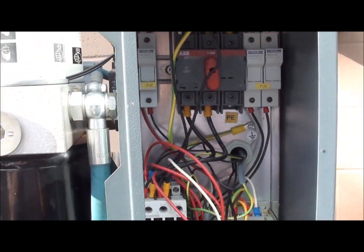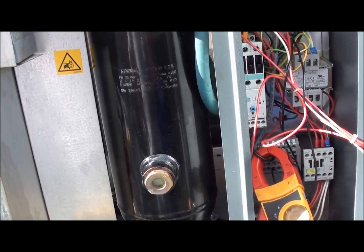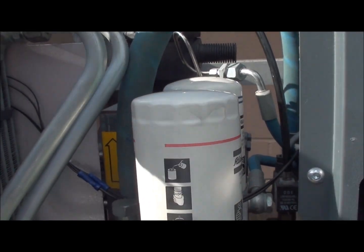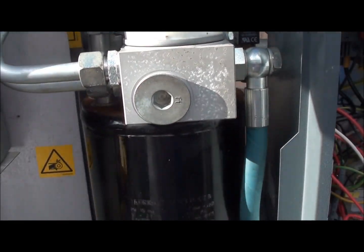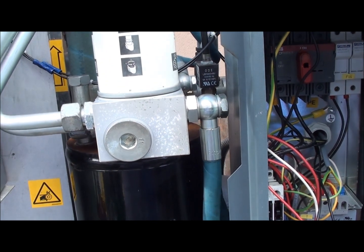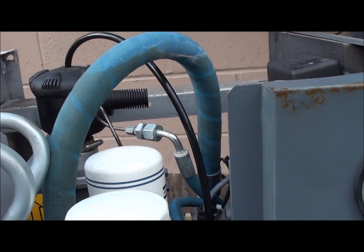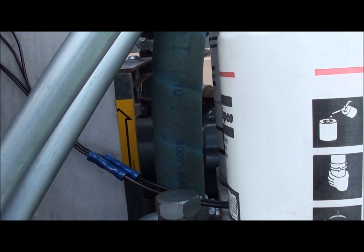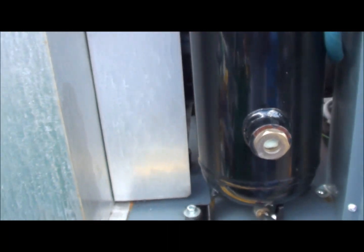This start-stop thing is a bunch of crap. Thanks for watching — in the next video we'll get into the intake. I already had it apart a little bit, and it's just a check valve — it's not really a throttling intake. For all practical purposes, this machine is just a start-stop machine all day long. There's nothing I can see from the factory that you could do to make this run continuously. I'm going to have to get inventive here, but my plans for throttling the inlet are definitely not going to work with the inlet that's on there, because it's just a check valve. Thanks for watching. Stay tuned.